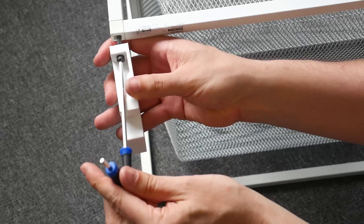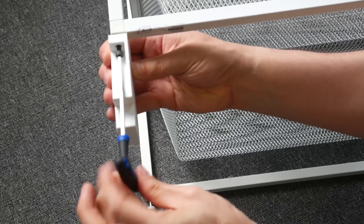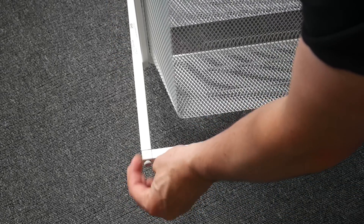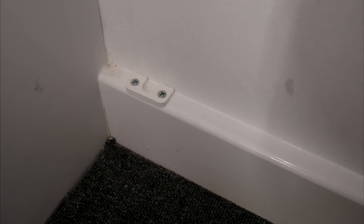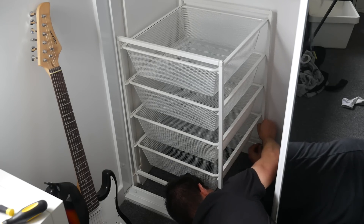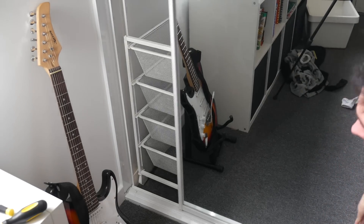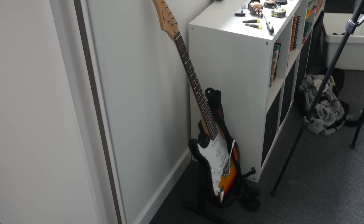The big bulky pieces are extensions for the front legs, mounted to the base using an M5 bolt into the existing screw thread. That angular cutout is simply to provide clearance for the allen key. At the back of the drawers, nothing actually attaches to the unit — all we need to do is screw the existing foot all the way in, because it's going to slot into the low-profile piece that's screwed into the top of the skirting board and sits flush against the back wall. There are two of these, spaced to match the width of the drawers. Step 1 is putting the whole set of drawers into position. Step 2 is making sure the rear feet lock into the slots in the printed part, which prevents the whole thing coming forward and hitting the door. Step 3 is to try and close the door, and be immensely satisfied that the problem has now been fixed. Ultimately the situation was saved, thanks to a simple practical 3D print.